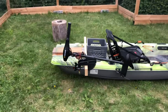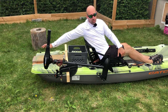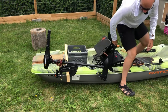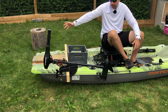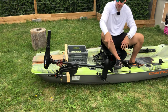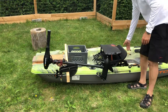With the motor mount Pelican sells — which is expensive — I'm 5'11" and I can't even reach the back to manipulate the motor. You need a booster and an extension for the throttle and you have to sit to the side. With my setup, right here I have access to raise the motor up, which is critical in a river system with rocks and shallow water — otherwise you're replacing a $150 motor every couple of weeks.